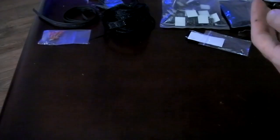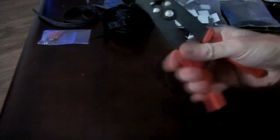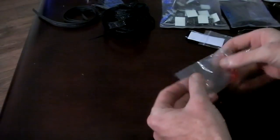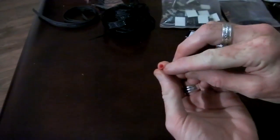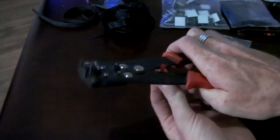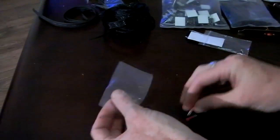Various tools I've got for cleaning: it's handy to have a little brush. A Phillips screwdriver is definitely needed. A flat-head screwdriver will come in handy for various other bits. Side cutters. I've got wire strippers — I don't actually use these as wire strippers, I normally tend to use the side cutters for stripping cables. What I do use the wire strippers for is the little crimp part, crimping little terminals. If you're installing switches you normally get spade connectors which come in various sizes. You literally push the end of the cable in and then crimp it, and it will just crush it and hold it in place.